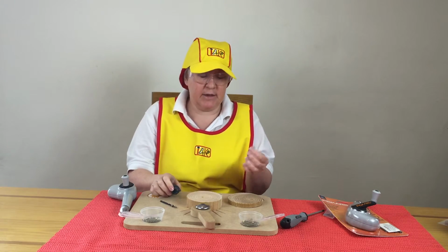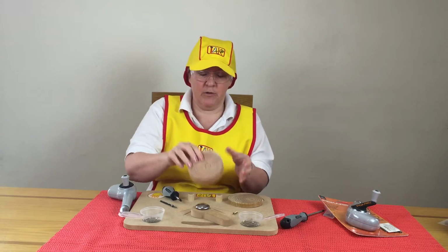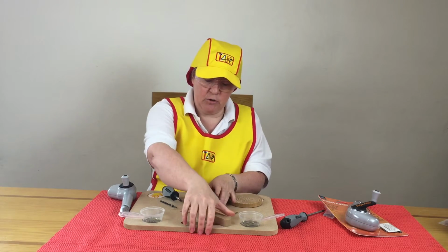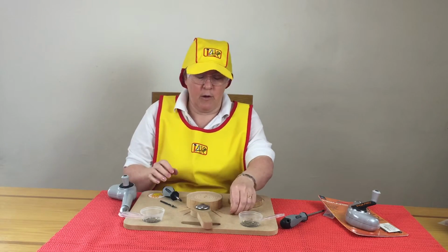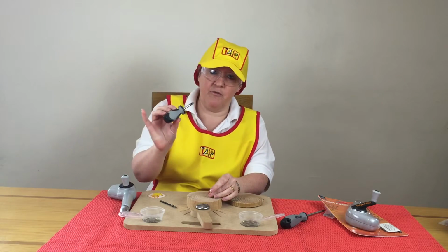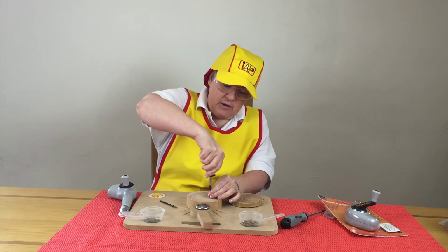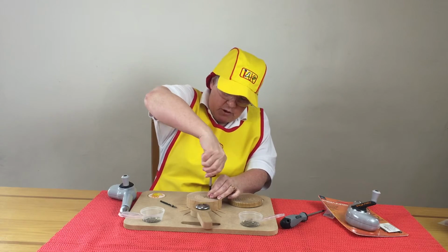What you really need is a hole to start with, a pilot hole. So I've got some on this piece of wood on the other side, and I'm just going to show you by comparison how easy it is. So now I've got my screw and I'm holding my soft grip screwdrivers again, be it the long one or the short one, and suddenly the activity becomes much easier.